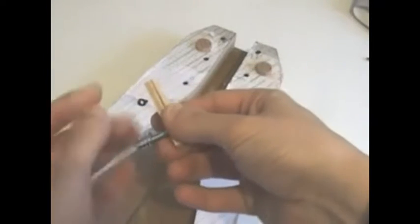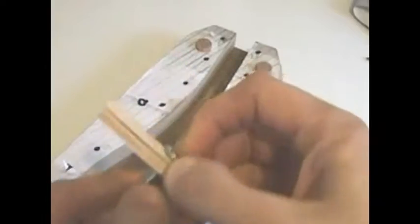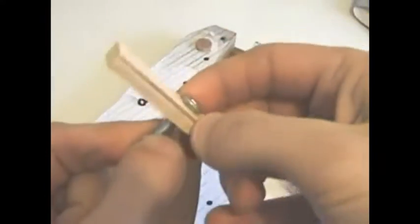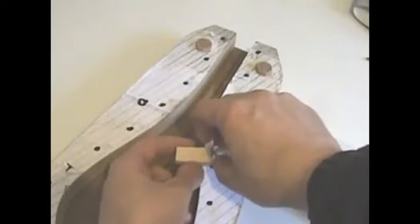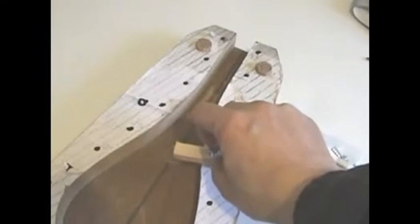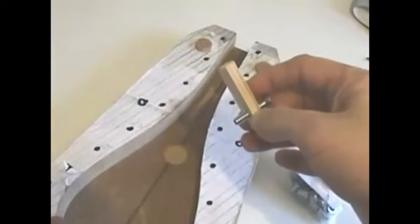And then when our ribs are in, we should be able to use this very simple, it's just a piece of wood. This is a 1-inch one, but I might use slightly longer ones next time. These just screw in, and you use the Allen key to tighten them up, and it means you don't have to have separate spool clamps that you have in violin making, and it means you can actually glue up the back and the front in one piece.